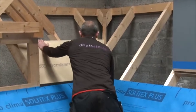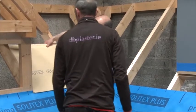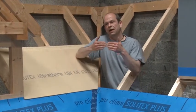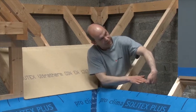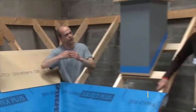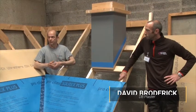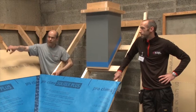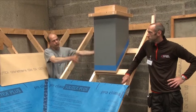For installing, it's actually not important that the boards meet at the rafters from a certain thickness, so you can just lay them out. If you have a joint in between the rafters you just keep going - they're strong enough with TNG for TNG. The TNG doesn't have to meet at the rafters, which makes it really easy. If you had to meet at the rafters that's pretty much a nightmare, but you basically just start one side, keep going, lay boards bang bang bang bang, cut it at the end, use the off-cut as a new starter.